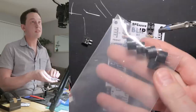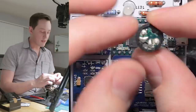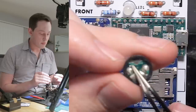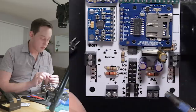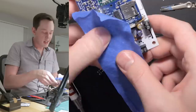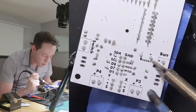Next up, let's tackle the buzzer. I've got my little bag of buzzers — we're just going to need one of them, and the buzzer is going to go right below the IMU. The one thing to note is that it does have a plus and a minus side — it's not bi-directional. The pin on the left is plus, the pin on the right is minus, and I have these labeled on the board as well. The plus is going on the left, so we just flip this over and in it goes. I'll tape over the top and turn it over to solder it in.